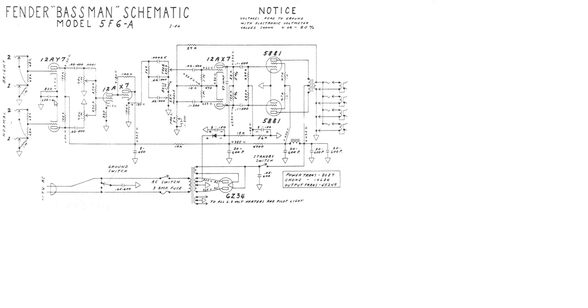Doug's changes are the same though. On his build he uses an 820 ohm resistor and 250 microfarad capacitor — it might even be 220 on the normal channel — while the bright channel uses a more standard value. So the normal channel is more bass-voiced and the bright channel is a bit more guitar-voiced. This was originally designed to be a bass amp, thus the Bassman name, and that's part of why the 820 ohm resistor and 250 microfarad capacitor help pass a lot more bass frequencies through.